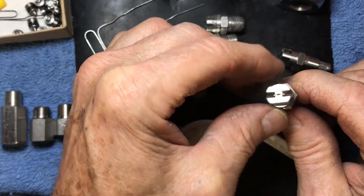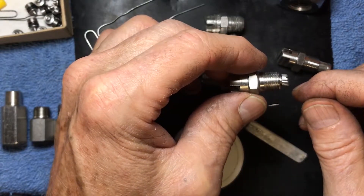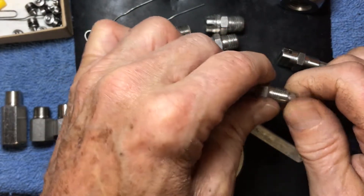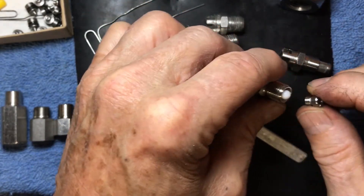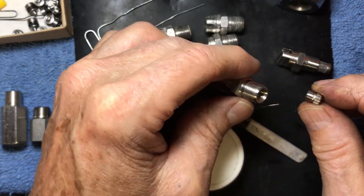About 10 years ago or so, I came up with this stubby check valve. Why? Because Pro-Chem Quadjet users were complaining about drippy jets. So we took the check valve that Stanley had for their one, got rid of the jet screen because it wouldn't fit in the manifold anyway, and made a little short cap.